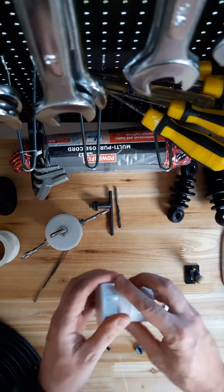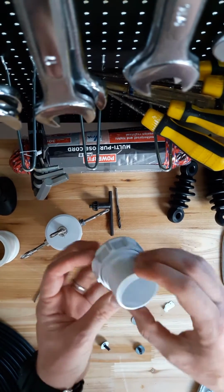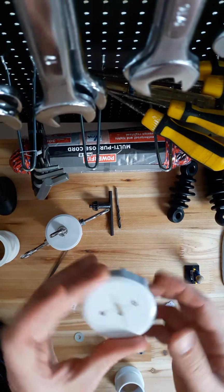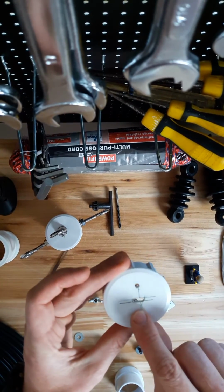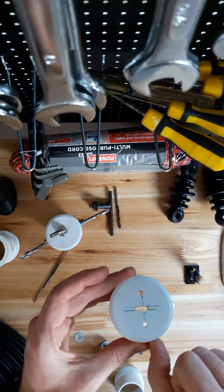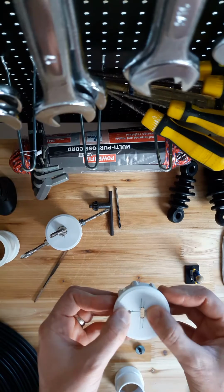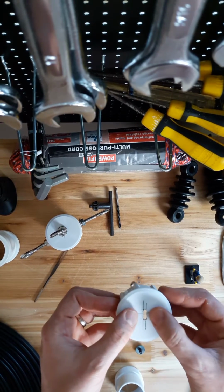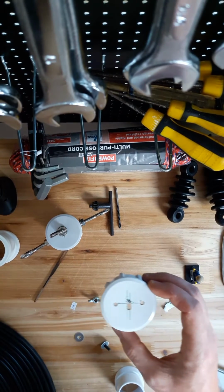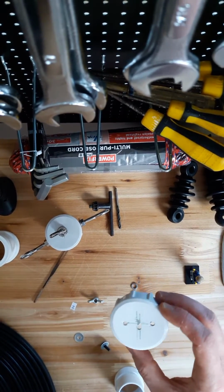This basically is the plug element of the waste pipe. Okay, so that's what it looks like normally. What I've done is made a slot for the 300 ohm ribbon, the ladder line, and 2 holes to the side. They are for some wing nuts that are going to hold down a fixing that will keep the ladder line in place, part of the mechanism to keep it hoisted up.